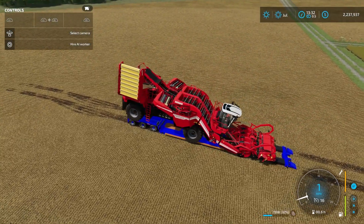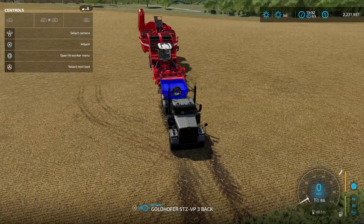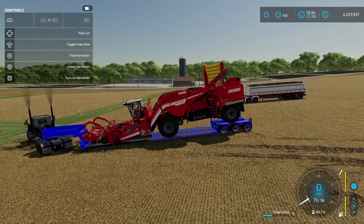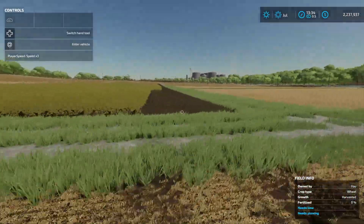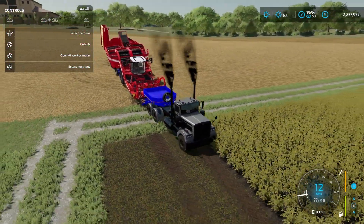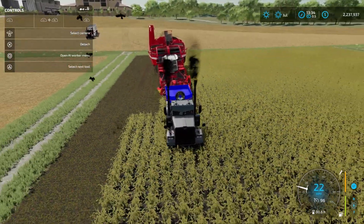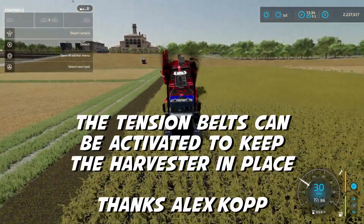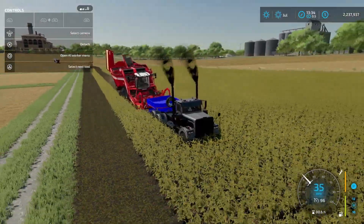Now you can see I've got plenty of room up here in the front. I'm gonna pull back forward just slightly to about right there. Now what I'm gonna do is go ahead and reattach everything. I need to make sure that my header is down — I'm gonna go up and then down one more time, and we're gonna go ahead and turn it back on. Then I'm gonna hop in my truck and we are gonna start pulling forward. Now you need to make sure that you're going kind of slow-ish. We said between 20 and 30 miles an hour, and yes, you are gonna be able to do that. You can see we're doing 35 right now — if you go very much more than that, you're gonna run the risk of actually knocking this thing off or sliding it off the edge.